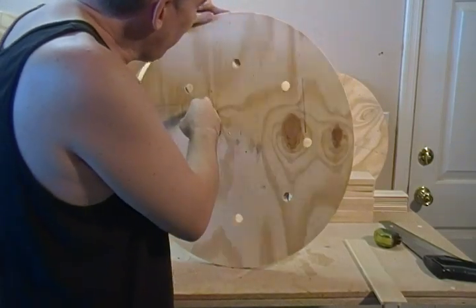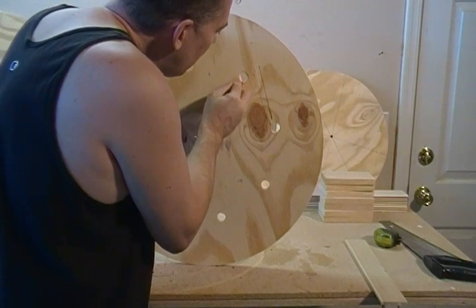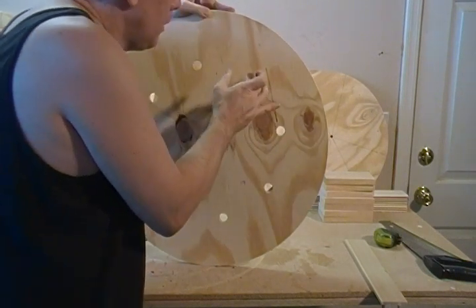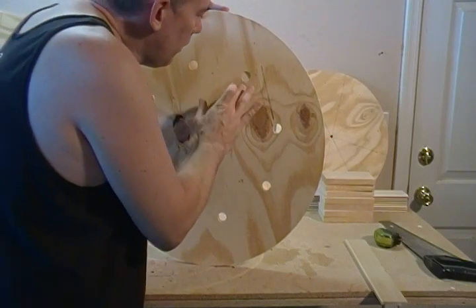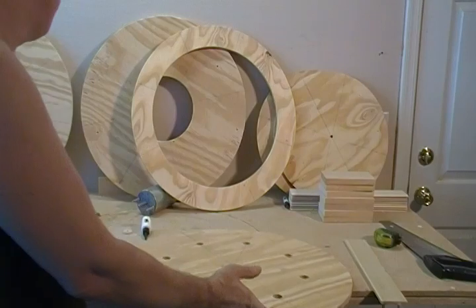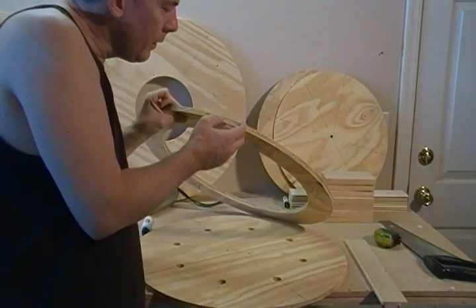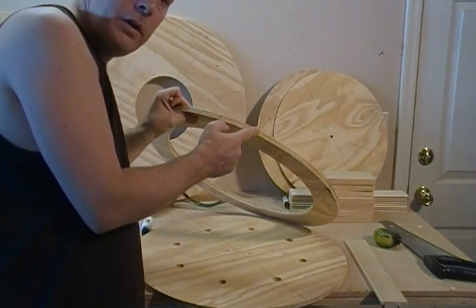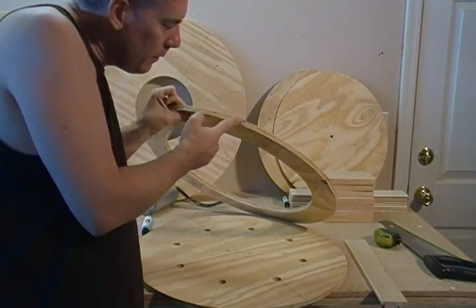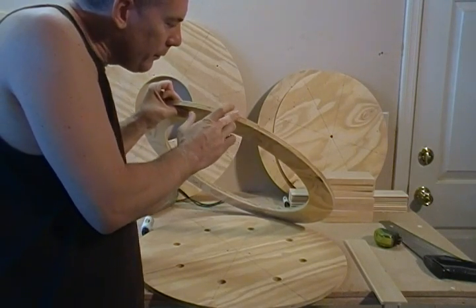Remember, we drilled the holes and chipped out areas. Some of these may be just cosmetic, but other things could really cause us problems. If you live in an area or climate where things can freeze, water can get in there and freeze in these little cracks. So we want to fill all that in as a kind of a pre-finishing step.